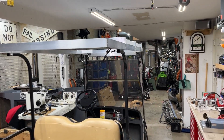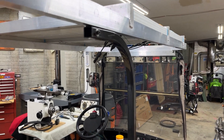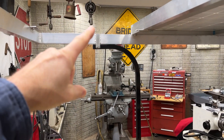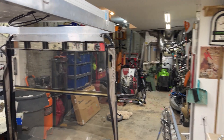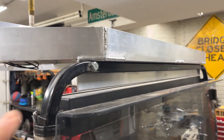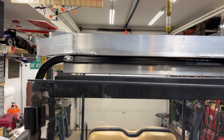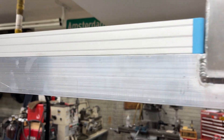I got the top on — looking pretty good. It was relatively simple to mount. You can see I'm sitting on top of this; the other top sat kind of next to it, so this is just a tad bit taller. I ran a strap down with a bolt — same on this side, you can see right there. For the front hoop, I just put a piece of angle up front and ran two fasteners on either side straight through. This also blocks the gap here a little bit to keep cold air from coming through. I did mount two solar panels up here — you can see how they're flush with the side.